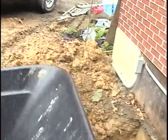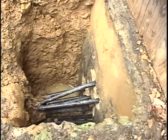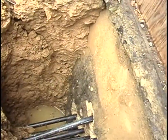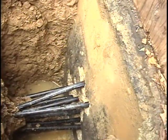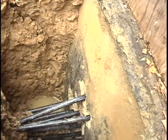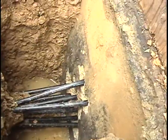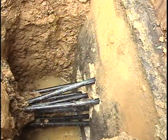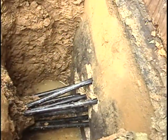As you can see, we've got the 10 pipes running through the concrete wall. We dug out below it to let some concrete get in around the pipes. There's one extra hole in the wall — when you join two forms of concrete, you should have rebar reinforcing the two slabs so you don't get a shift. That extra hole is for rebar, and it's already plugged from the other side with expanding foam. I'm going to put a piece of rebar in the open hole, and then mix up about 12 bags of concrete to form it nicely around those pipes. It should be dry by tomorrow, and then all I have to do is fill it in with dirt.